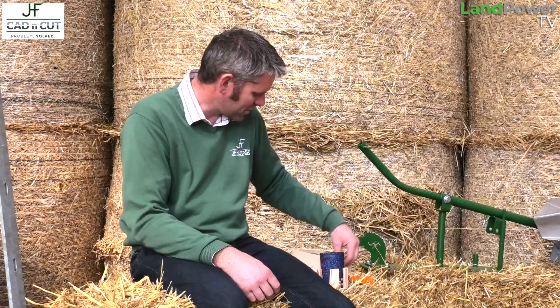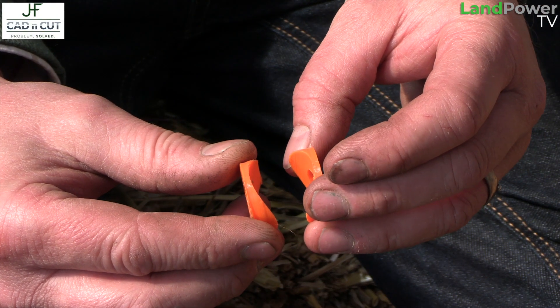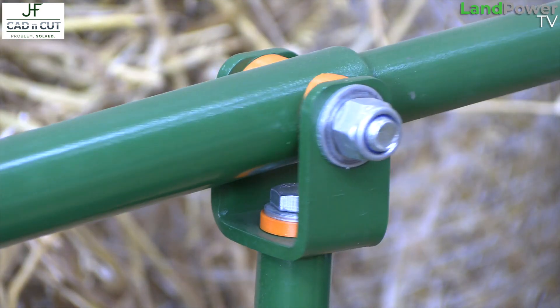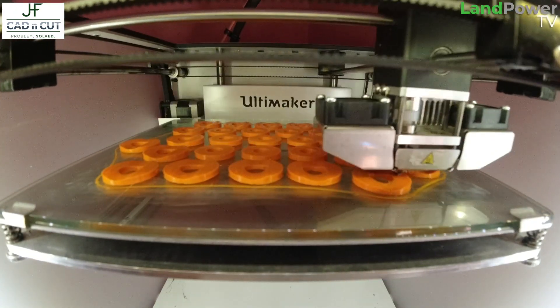In the liner changer there are parts that were 3D printed to go from a round tube to a square — they're relatively cheap to produce, quick and easy, and there's little to no waste because you're not cutting anything; it's printed in the shape you wanted. You can also be quite resourceful because it doesn't have to be solid — you can alter how dense it is, how much fill there is within that part. You basically tell it whether you want 10%, 90% or 100% fill, and it creates a lattice inside.